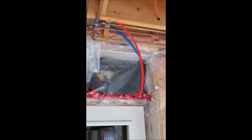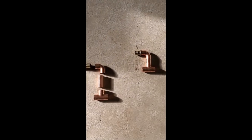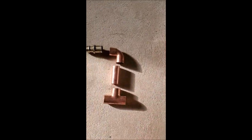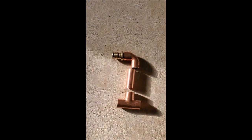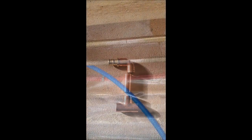I'm going to show you — we put in some copper adapters on those copper lines, the hot and the cold. We put a tee, a PEX adapter, and we'll solder it on the copper, then put the expansion on the PEX. This is what we're putting together: the copper to PEX adapter. You've got a tee, a little riser piece, a 90, and the PEX adapter. A little trick — these adapters fit inside the 90s, so that's one less pipe to cut and one less solder connection. They're great.